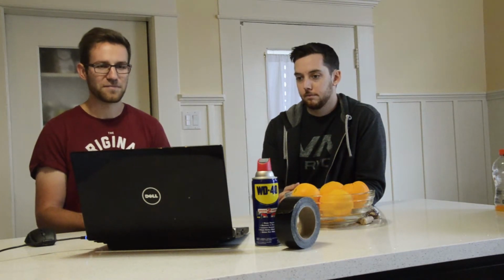Another important thing is if you do things improvising with basic tools, tolerances are really important. Never think you can work as accurately as with a drill press. If you only have a hand drill, make sure your holes are big enough.